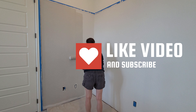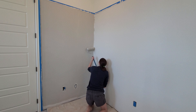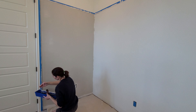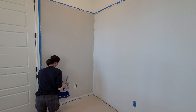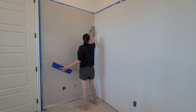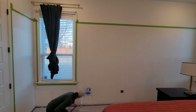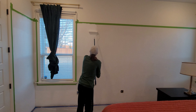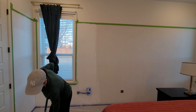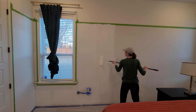When you do the lime wash, you'll see that perfection isn't necessary — you just need a smooth surface. Once I did the entire room I applied the second layer of mud, this time a little thicker — like a thick pancake batter — so it went on more smoothly. Again, roll it on and then take your taping knife. I used a 12-inch taping knife: any bigger and I couldn't control it, any smaller would take too much time. Smooth it out and scrape off the excess. Getting it slightly wet also helps add smoothness when wiping it clean.